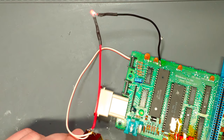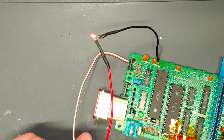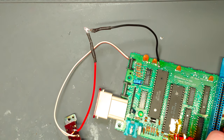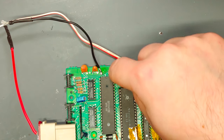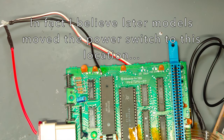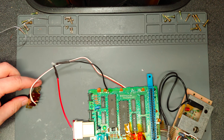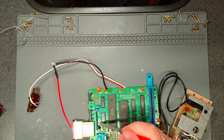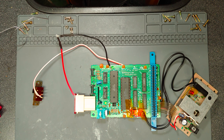That's interesting — it's always on. So I'm guessing as long as there's power coming into this board, there's always 5 volts coming out. Guess I'll have to pick a different spot for 5 volts. Rather conveniently, that's 5 volts right there — almost too convenient. But I can also pull from one of these pads here as well. We'll just go right there since it's convenient.